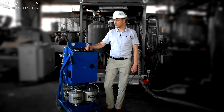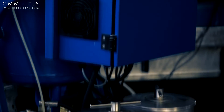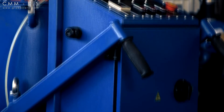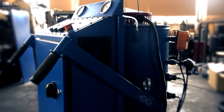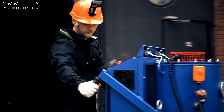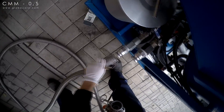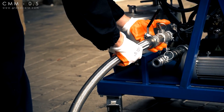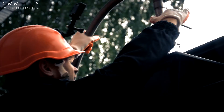The CMM 0.5 unit is a completely new design for purification of transformer oil in the GlobeCore lineup. It is designed for pumping, heating, degassing, and purification of dielectric oil by removing particulate matter and moisture. The equipment can be used by small transformer maintenance, repair, and operation facilities.